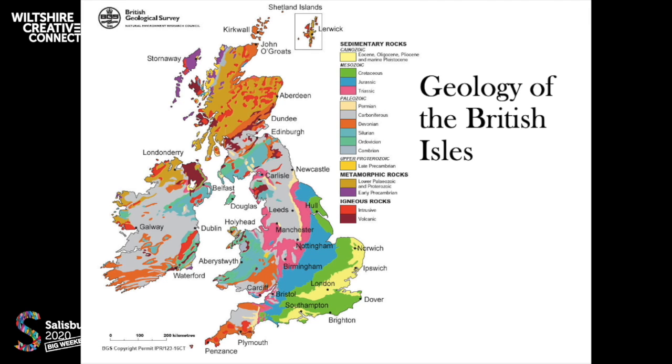So because all the low walls are built of flint and this really hard mortar, what tends to happen is that it expands and contracts, but there's no give in it, so it tends to fracture, and then water can get into the medieval core and cause it to disintegrate.